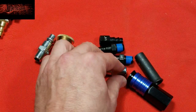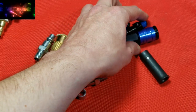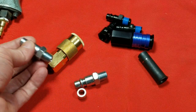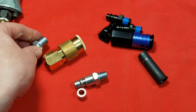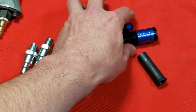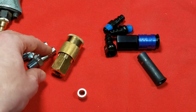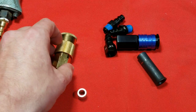In somebody's home shop, if you're already invested in those Miltons, Cobalts, or these Harbor Freights, then you're kind of stuck with it. Otherwise, just get industrial 3/8" IM standard — industrial Milton 3/8" air fittings and couplers on quarter-inch MPT — so they'll be compatible with all your current tools. You will get all the high flow of all these fancy high-flow fittings, and in any situation where you take your tool to an industrial shop, welding, all that stuff, it will work on all the 3/8" equipment. It will just fit up because that's the coupler standard they're using.